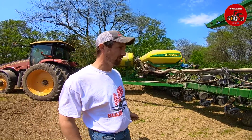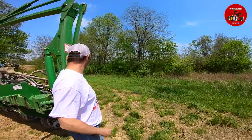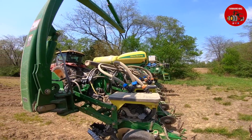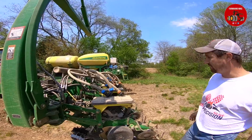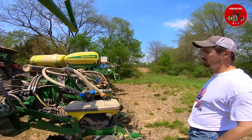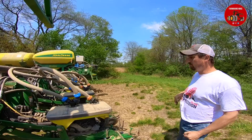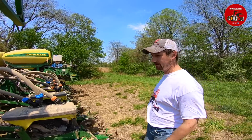We've built this one up with the meter system. We've got Precision Planting's V-Drive system, which uses our V-Set back meter, and then we've got our Speed Tube, which is a high-speed attachment. This is also a multi-hybrid planter using Precision Planting's M-Set control, which is a new single-meter multi-hybrid system where we can switch back and forth between hybrids by prescription or manually as we're going across the field.